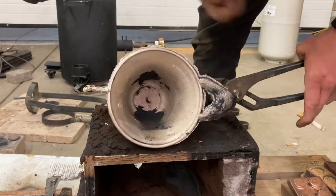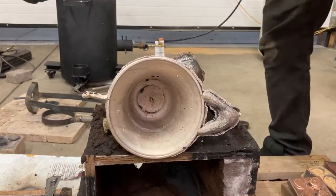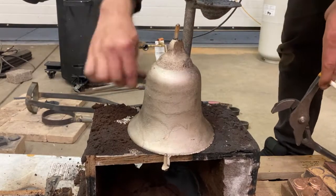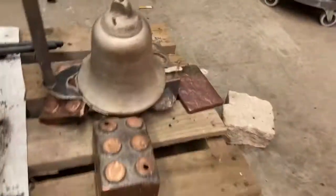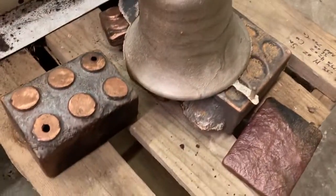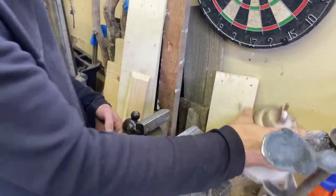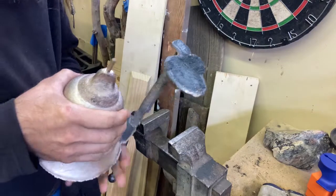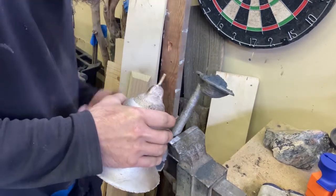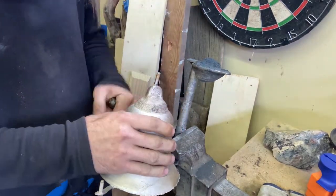I use a brass brush on bronze because brass won't score, scratch, and ding the bronze, but a steel brush can actually wear brush marks into the piece. So check those Lego brick weights out. Those are fun. Those are pure, high quality electrical wire copper. Yeah, might as well make those blocks big so I can use them for something else.